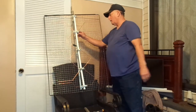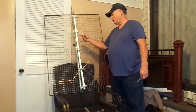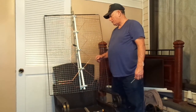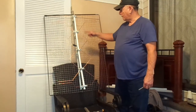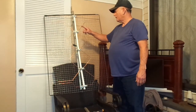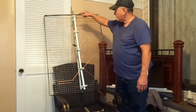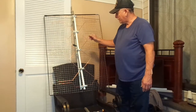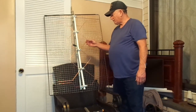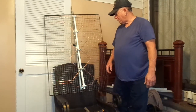Then you put the lock washer, washer, and nuts on. You could use a bolt, except you'd have to bend these individually as you put the bolt in, which would cause big problems — it was hard enough bending it without it in its stall. These are seven inches — seven, seven, seven, they're all sevens. This is what they call a hat, and the hats are not electrically connected. This is one side of the antenna and this is the other side. This is a transformer — the TV signals are 300 ohm, and this makes the 300 ohms into 75 ohms so that you can plug into the back of your TV.